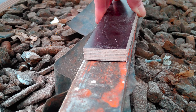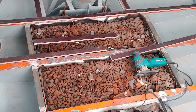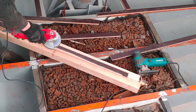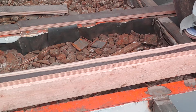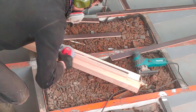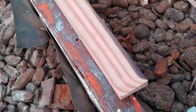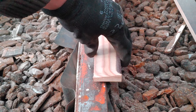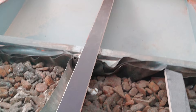Here you can see how much these angle profiles are bent in some places. First I trace the area that is bent onto the narrow wooden beams. I then use the angle grinder with a sandpaper disc to cut some kind of a slope running alongside the beams. You can see the different layers of the plywood appearing progressively as I sand away more and more material from the wooden beams. At first sight this seems about right, so let's do the other beams that need processing and then we can put the boards back and see what we got.